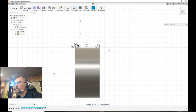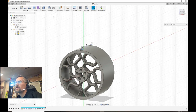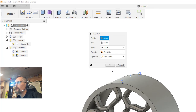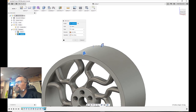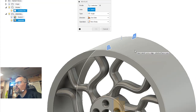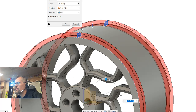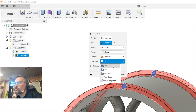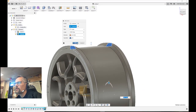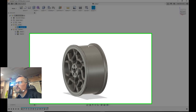Those are the dog ears. Now you're probably wondering what we're going to do with those. But if you look at them from a 3D isometric view, they're kind of right up on top, touching the tire. So at this point I'm going to choose another feature called a Revolve. Choose Revolve, and then we're going to select the dog ears and select the axis the same way we did with the circular pattern. At the moment it was embedded a tiny bit into the barrel, so we're going to turn off Cut mode and turn on Join mode. When we do that, we end up with these two pieces actually touching. If you're careful when you draw this, you won't get that line if it comes right off the edge of the rim — but don't worry about it, it's fine.